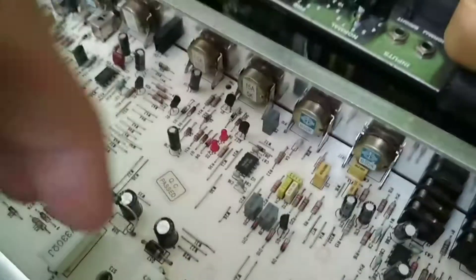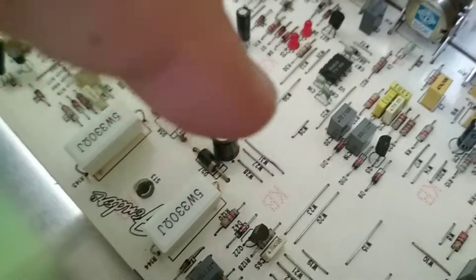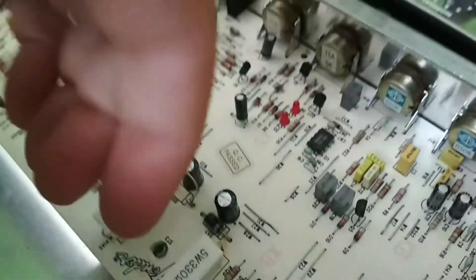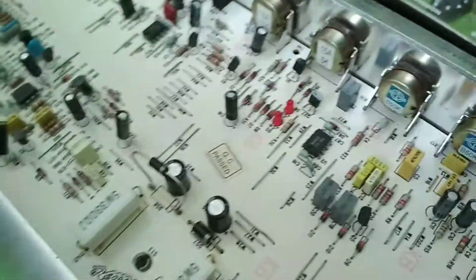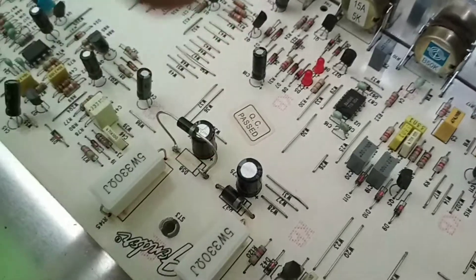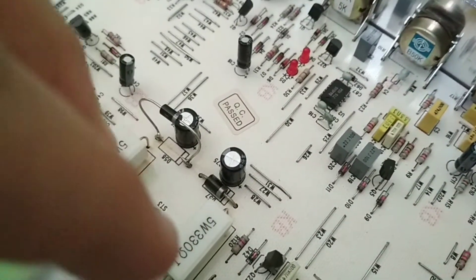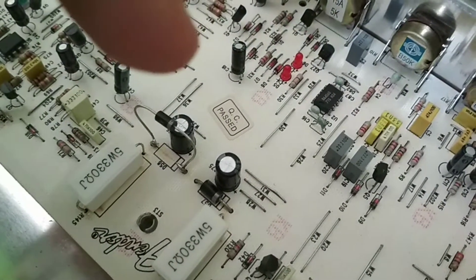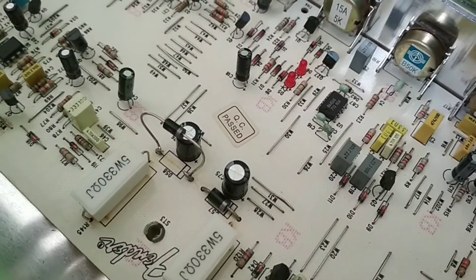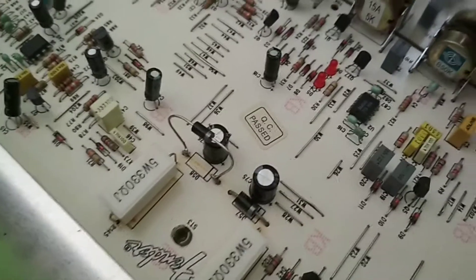And then this side is your plus side, and in fact I've got this switched on right now. You can actually see some brown marks around the PCBs here, and that's because this crude power management system is producing a lot of heat. Waving my hand over the top, I can feel the heat coming off these 5 watt resistors - they probably should be 10 watt resistors. Replacing this diode did the trick. The diode probably blew and then with no load, these resistors overheated. Both these resistors were well out of spec and the diode had a crack in it - physically broken in half. There are some burn tracks underneath on the PCB, but they are intact, so I've put a coating of nail varnish over the top to protect them and keep them intact.